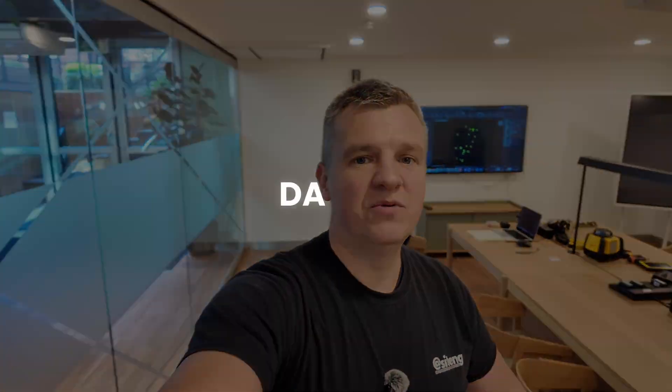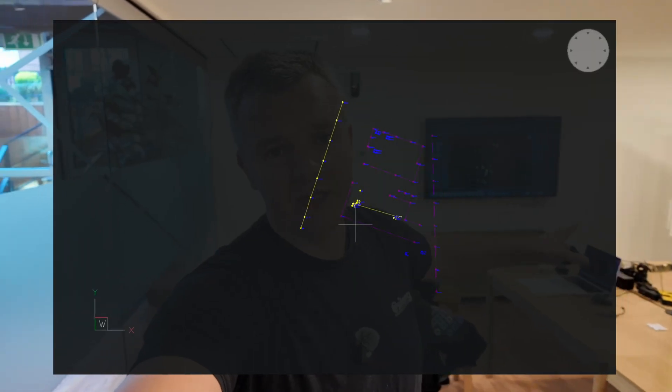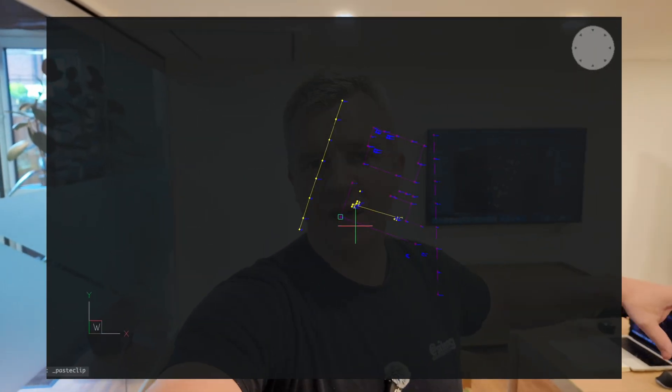The datums are set now for tomorrow. On the second day of the course, we're going to start by reviewing the survey we did yesterday — combining the surveys and seeing all the area we worked on. Yesterday was mostly basic stuff: total station setups, resection, and the as-built survey program. Today we'll quickly go through yesterday's work and then move to laser leveling exercises.